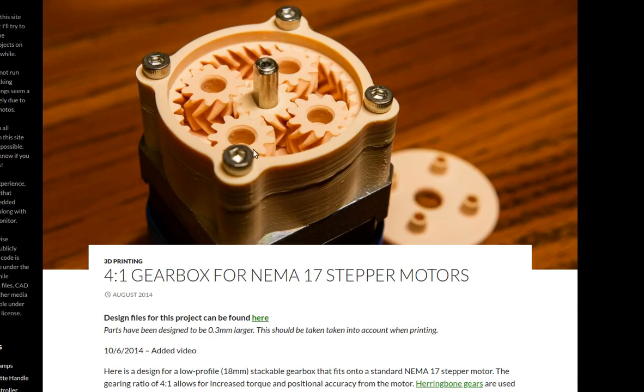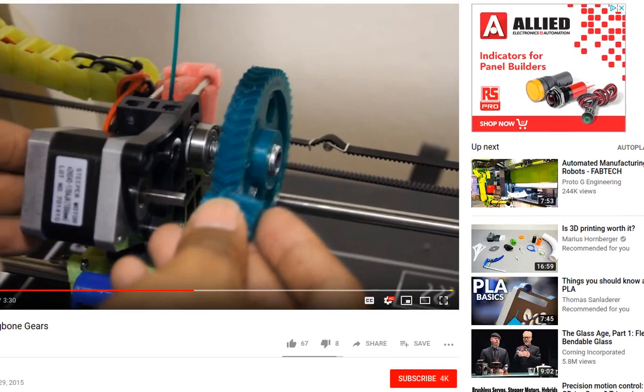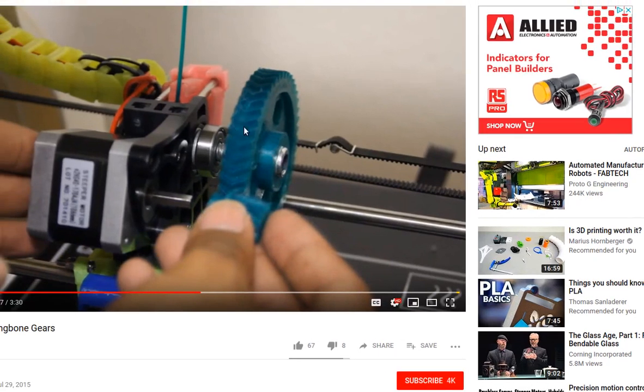That's exactly what I want to do. I want to use this motor with the gear down so that I don't have to use another gear down for the extruder. Like this geared extruder here in this picture. They use this small gear to drive this bigger wheel, with like, I don't know, a 5-fold gear down for an extruder application, because you need a lot of force to push the filament through. So applications like that are completely doable, and practical.